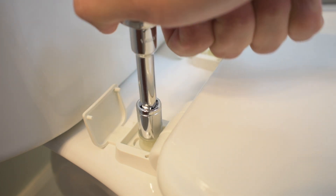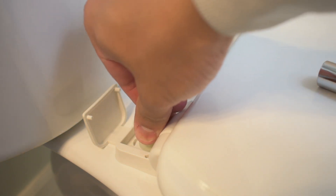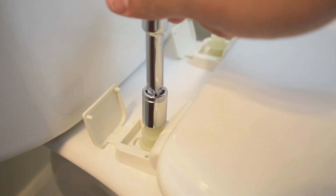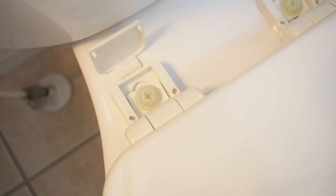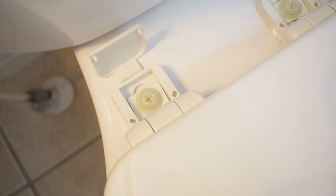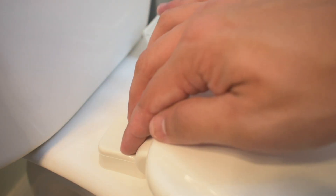The hardware that's given in this toilet seat is actually really nice because it's plastic — if you continue to tighten, it'll snap right off that little bolt on the top, so there's no question as to whether it's under-tightened or over-tightened. If you try to over-tighten it, it'll just snap. Here's a close-up of the bolts after they're tightened. If you want to replace it again, just unscrew the bolts, snap those caps closed, and you're done.